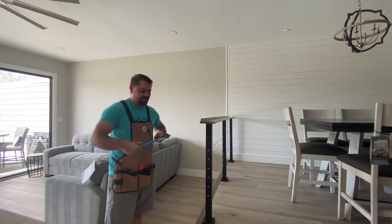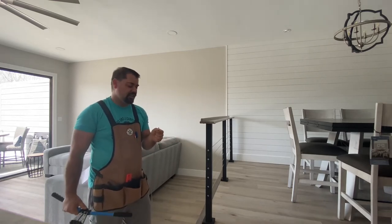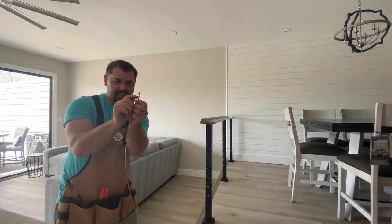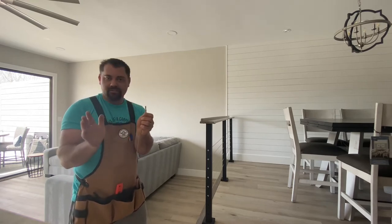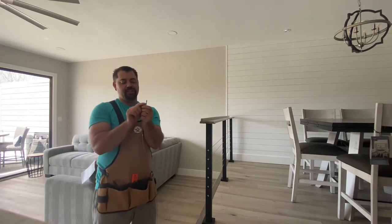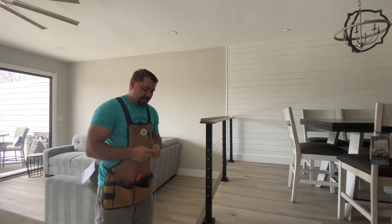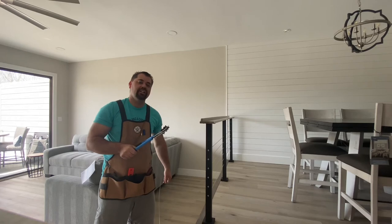Okay? And you'll notice I crimped everything twice, and that's in the directions, just to make sure you get a solid connection. I've also noticed that when you're going to the collet to crimp it, try to crimp it not right at the top of that ridge, but about maybe a 16th below. One of them I crimped slightly made the threads go this way. It didn't mess with the insulation at all. It was no problem, but I haven't gotten that since, and I've just been dipping down about a 16th of an inch off that raised ridge for my first crimp, and then the other one I put right below it. Yeah, it takes a fair amount of tension, especially the first time you do one. I've found leveraging against your body helps.